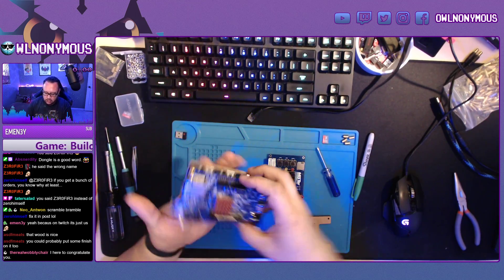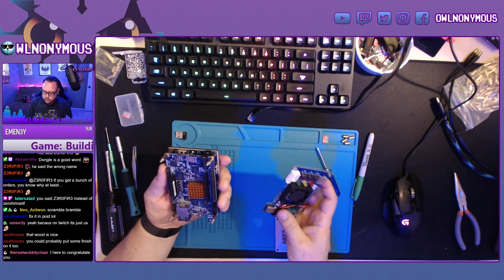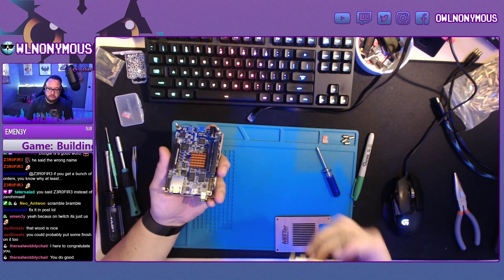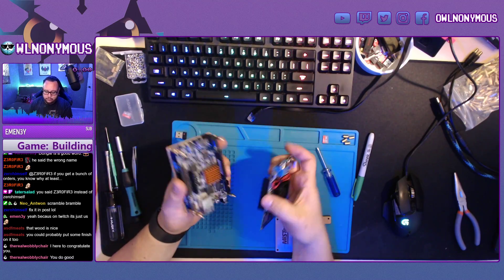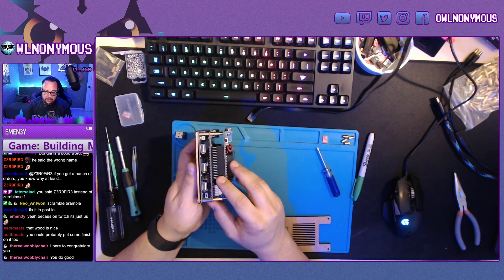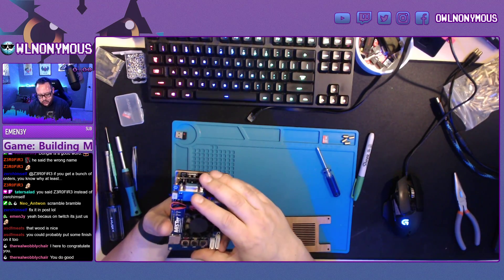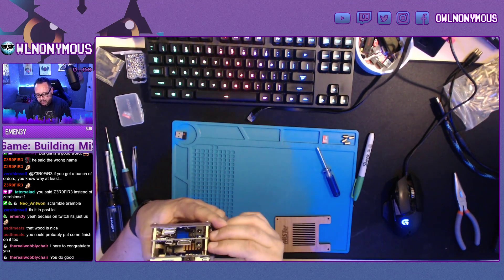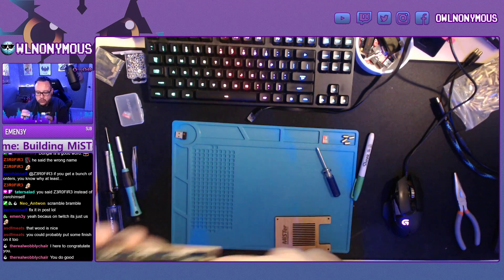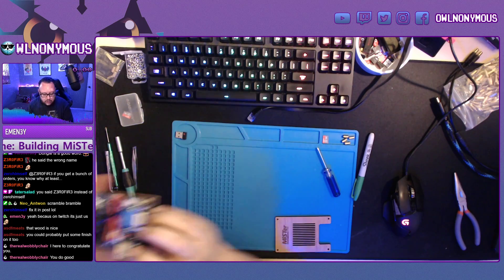Next, I like to install the analog I/O. You have the Ethernet port and the buttons facing towards you. Line up the big black connector with the pins, then make sure standoffs are all lining up correctly, as well as these pins over here — you want to make sure they are all correctly in there.